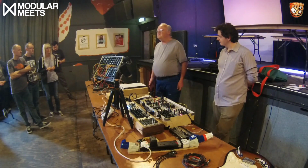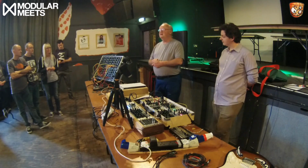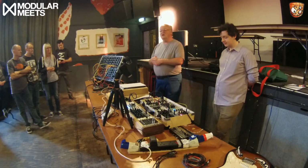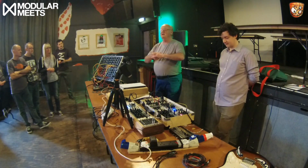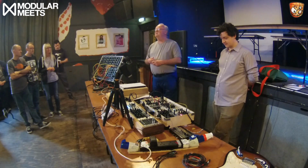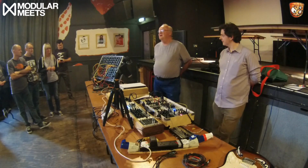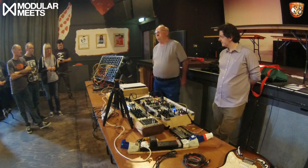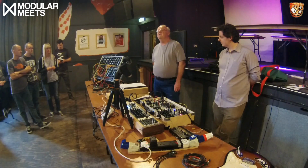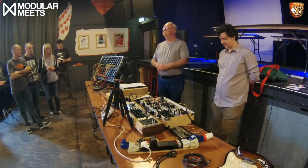There are some problems with just using a FET like that. It generates second harmonic distortion, and if you put half the signal between drain and source onto the gate, then you can null out that distortion. But at the tender age of 15, I knew nothing of that. It was just a voltage control resistor as far as I was concerned. It was rather fortuitous in a way, because part of the thing about the Gristleizer is it's not clean. No part of it is free of distortion, and a lot of it comes from the quirks of JFETs, of which this is one.